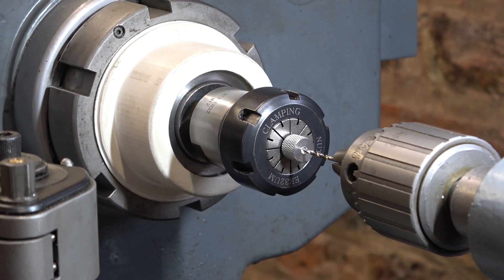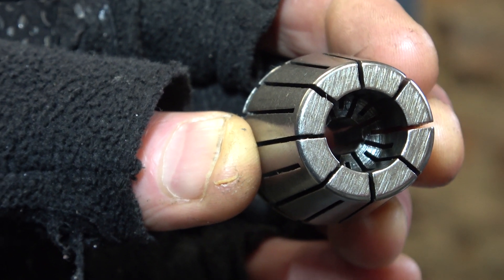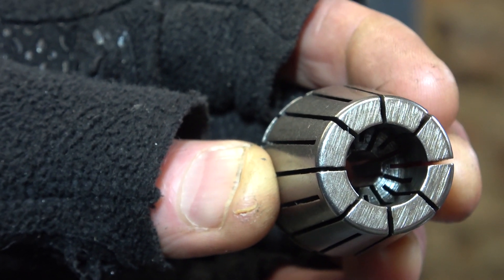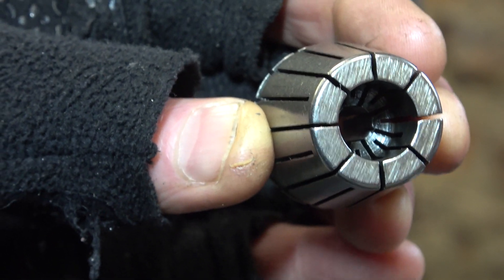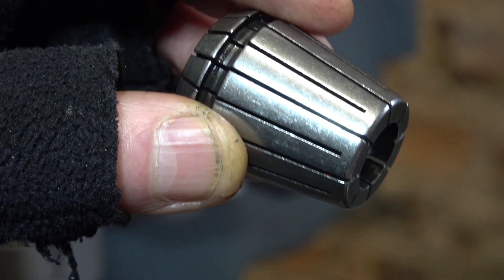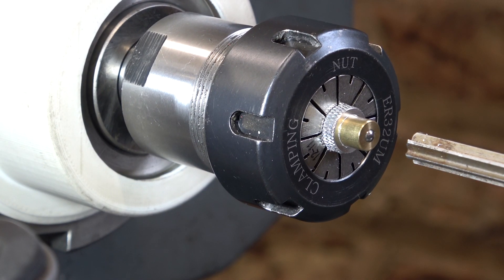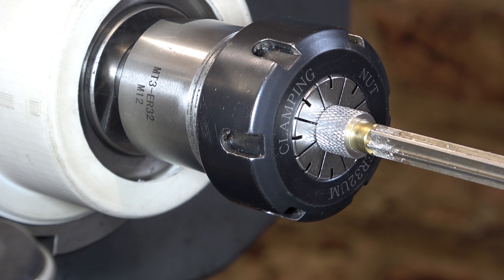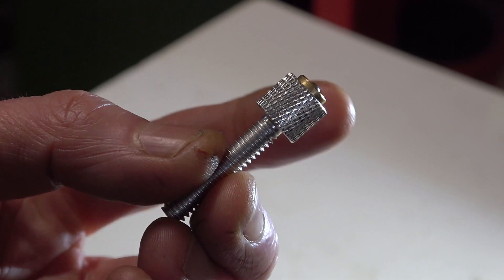Next, a 2 millimetre drill to a depth of 20 millimetres. Just on what I was saying about ER32 collet clamping — this is a 7 millimetre collet and you can see where the jaws are; you need a piece of work at least the length of the jaws. On the larger collets, I believe the work has to extend all the way to the back. I've just test-fitted that — I drilled it out with a 19/64ths drill, or 7.5 millimetre, and then reamed it. I think that's going to be fine. Let's see if it will press in without squashing. There we are.